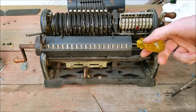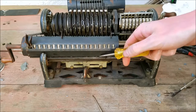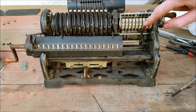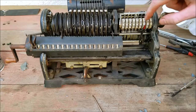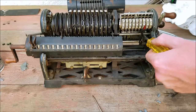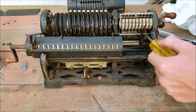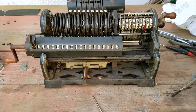This rod, which is driven off a gear from the teeth on the back of this carriage, has to be timed appropriately so that when the carriage is locked in a position, this rod is also locked in the right position. If you have that off, this gear is going to be trying to drive into one of these wheels, or this tooth will hit on these pins as this spins around. So the positioning of this shaft and the positioning of this tooth on the little cog here will have to be timed appropriately or the machine won't work right.